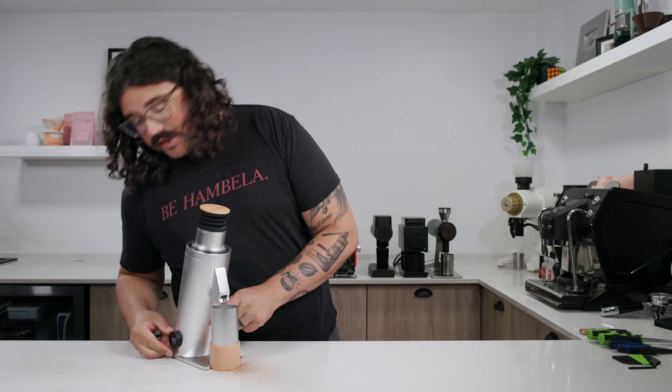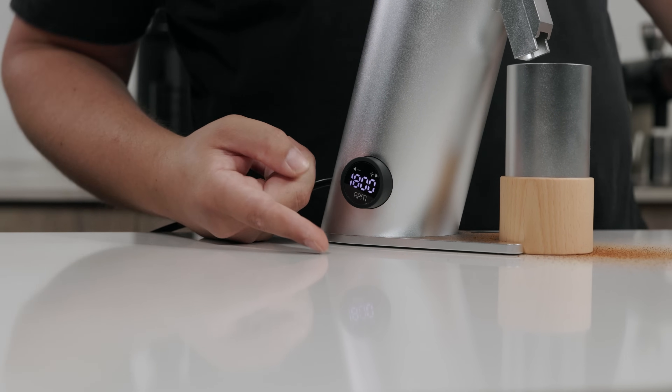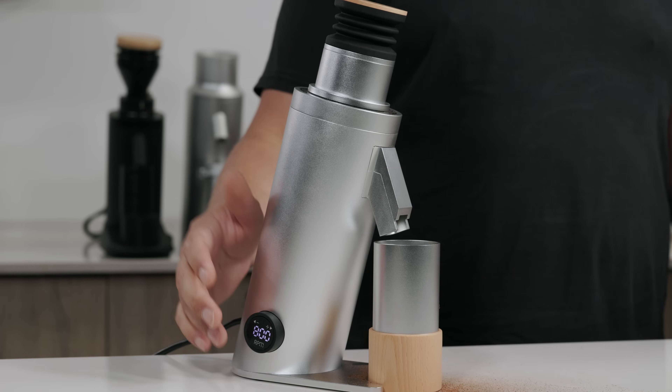On the side there's an LCD screen. Going left brings the RPM down to 600, and going right brings it up to 1800 RPM. Tom Poland on YouTube has a video using a strobe light to verify RPM accuracy, and every position tends to be right on the money. For the first time in the DF series, they've introduced a brushless DC motor. The biggest practical difference from a brushed motor is you may need to change brushes over time with a brushed motor; with brushless you don't, though you do need a controller board.